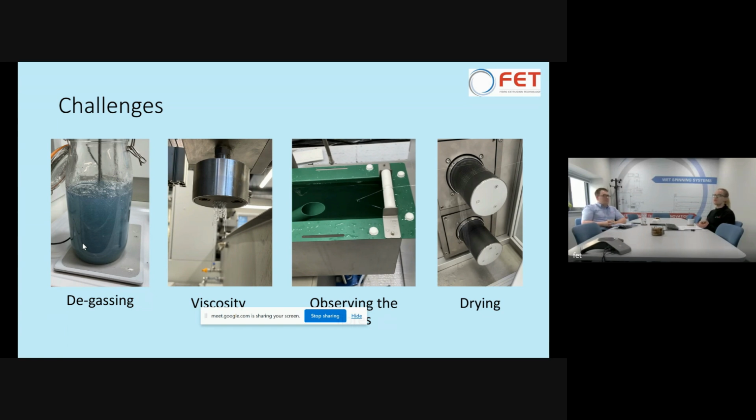Now, when you have a more viscous or more concentrated solution, this can be helpful because it makes a very strong fiber at the end. However, in the opposite direction, if your viscosity is too low and your spin dope is too runny and not very concentrated, there'll be very little amounts of alginate that you're coagulating, and this can produce a very weak, thin fiber that is difficult, if not impossible, to process, and then doesn't have very good properties in the end.